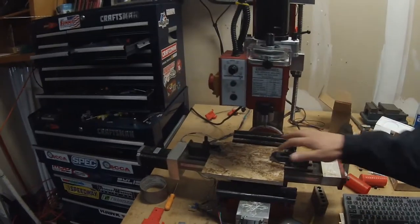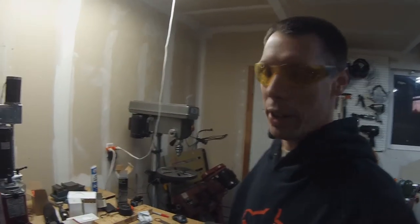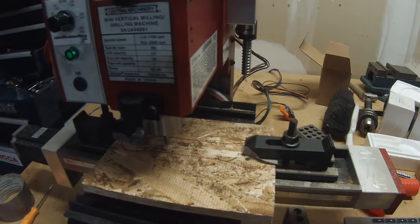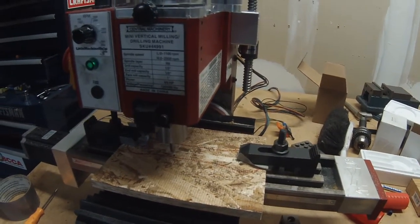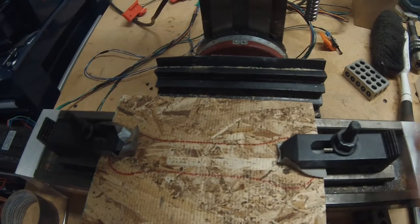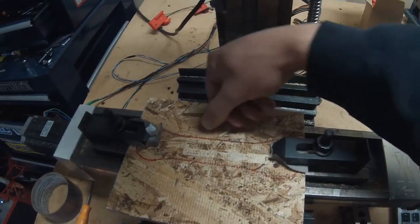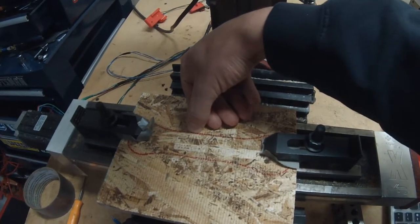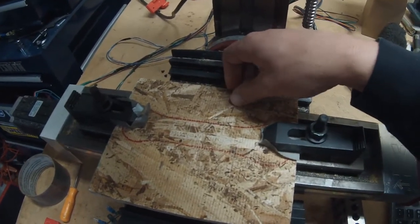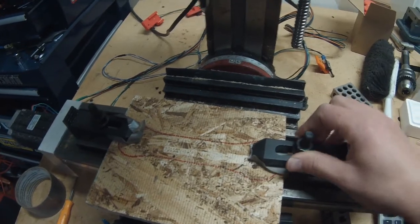Just to be sure, I went ahead and just traced my bottle opener on here, and I'm going to go ahead and run it on a piece of wood. It looks like it's doing what it should right now, so I'm going to let it run. Just very lightly engraving. So there you have it. One thing I noticed is I touched off on the center of this line and called that my Y, so it's really close. I think it turned out pretty good — honestly it's pretty straight. Just gotta make sure I touch off on a couple points to make sure that it's straight.